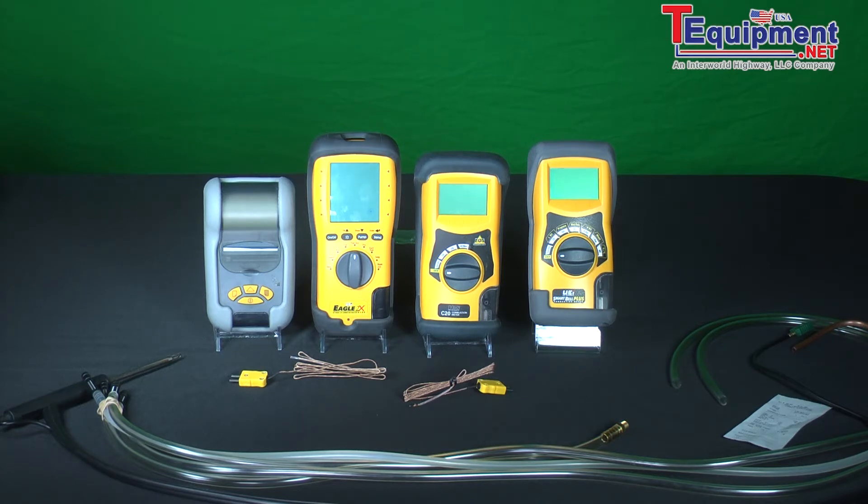It's similar to a battery in a flashlight without an off switch — every year or two it's going to wear out and has to be replaced. Typically we measure CO, O2 and calculate CO2, so you measure two gases and calculate the third.